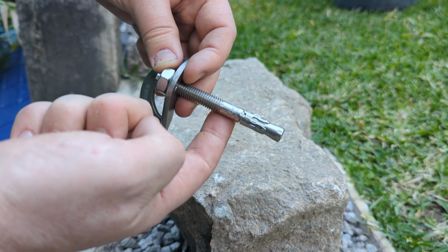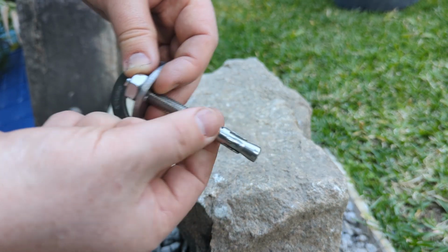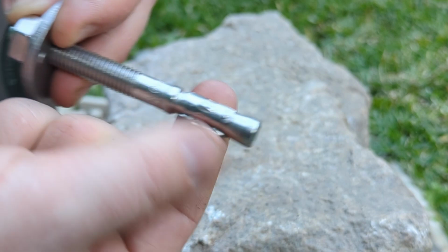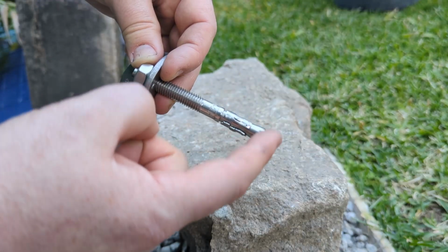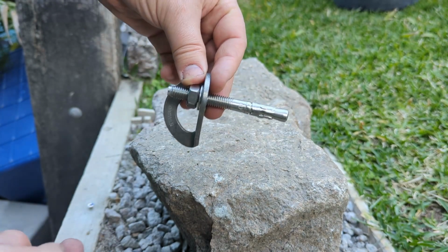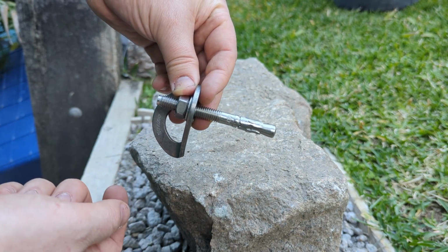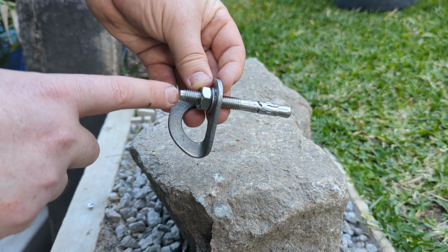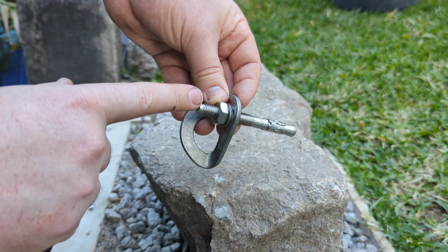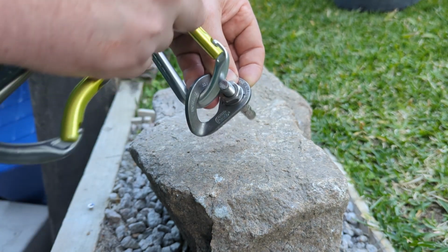Once that clip part is embedded in the material, your rock or your concrete, it's not coming out. The clip automatically engages, with nice friction bumps on there to keep it in the hole. Then that expands over the wedge, and that locks it in place. So if you haven't drilled your hole deep enough, you won't be able to just pull it out and try again. If your hole isn't deep enough and you only get them in, say, that far, that'll still work. It'll probably still be strong enough for your purposes, but you will have all this stuff poking out the end, and that's not great. You may need to come back with a grinder and chop that off, because a big bolt poking out like that is potentially hazardous for your climbers. Firstly, as an injury risk, but also for snagging carabiners on.